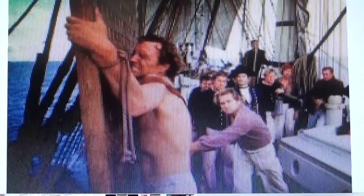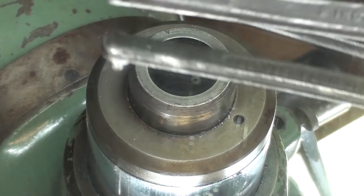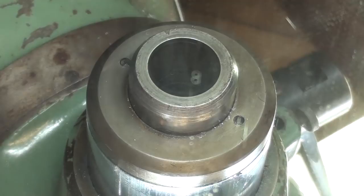As you can see in the dirty mirror, there are two holes here for a spanner wrench. So you need to have a spanner wrench like this or make one. Whatever you do, just do not be a punch and hammer man and hammer it out. That probably would do the job, and you're going to see probably a lot of these that are mangled because of Bubba.